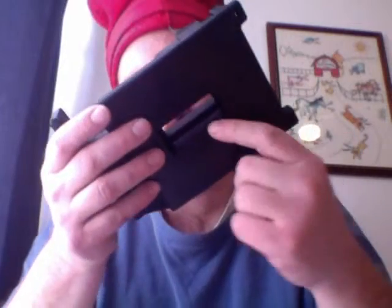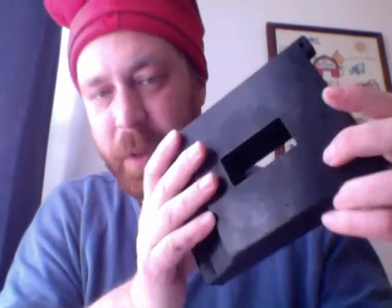As for Liquitex paint, I don't know the brand Liquitex. Maybe that's an English or a California thing. I have a couple of paint preferences for camera building, although I don't use any paint in the Brancopan. My first preference is a Plasti Dip, matte black spray Plasti Dip. And this is basically a spray rubber. It is not a strong coating. You can scratch it off. You don't want to use it on exterior parts. But things like if you were having issues with reflection in here, which I don't think you should because I haven't, but who knows.